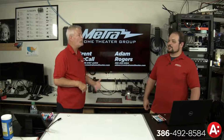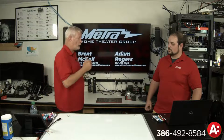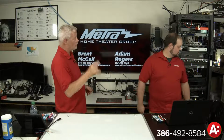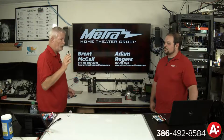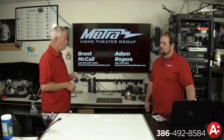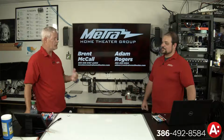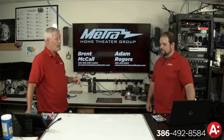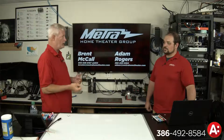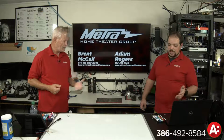DVI, which predated HDMI, took that same component philosophy, or actually kind of the VGA and component, a red, a green, a blue, and a single horizontal and vertical clock. Now, DVI did not have audio. Could DVI have had audio? Yeah, because audio is on the TMDS lines right now. It just was not built into the hardware. It was not a limitation of the signaling process, the hardware just didn't do it because they thought, what do I need audio for? Audio is a separate feed, because it wasn't meant for the consumer.